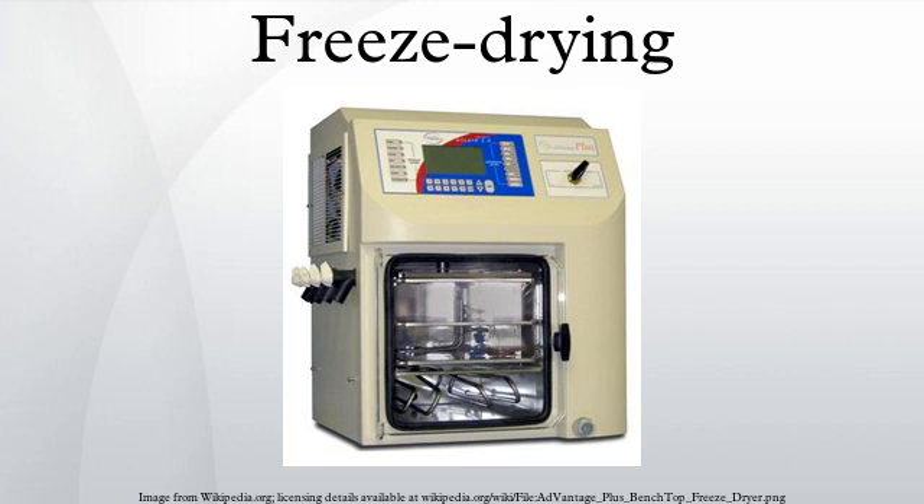Technological industry. In chemical synthesis, products are often freeze dried to make them more stable or easier to dissolve in water for subsequent use. In bioseparations, freeze drying can be used also as a late stage purification procedure, because it can effectively remove solvents. Furthermore, it is capable of concentrating substances with low molecular weights that are too small to be removed by a filtration membrane. Freeze drying is a relatively expensive process. The equipment is about three times as expensive as the equipment used for other separation processes, and the high energy demands lead to high energy costs. Furthermore, freeze drying also has a long process time, because the addition of too much heat to the material can cause melting or structural deformations. Therefore, freeze drying is often reserved for materials that are heat sensitive, such as proteins, enzymes, microorganisms, and blood plasma. The low operating temperature of the process leads to minimal damage of these heat sensitive products.